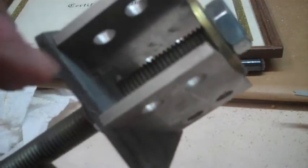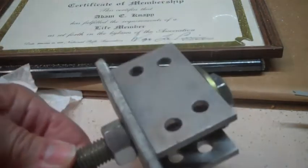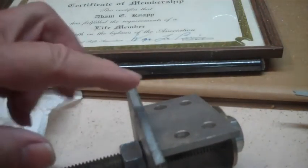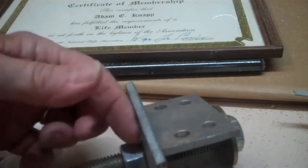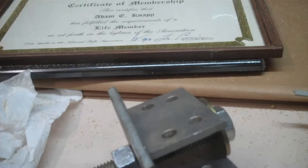So down here, I've grooved this and recessed it. I'm going to get in between here and tack it, then turn all this around, tack it again, and then weld it. I want this to be as at a perfect 90 degree if I can get it, but it probably won't be. So you may have a little high-speed wobble in your Lazy Susan.